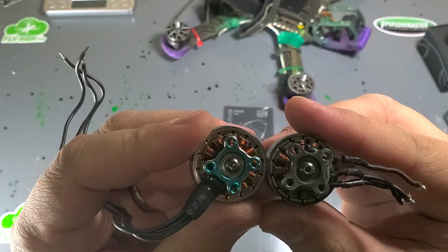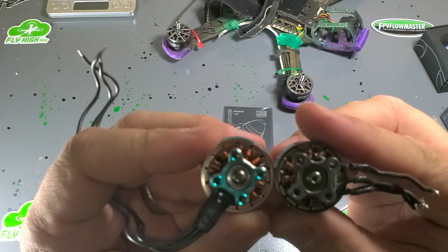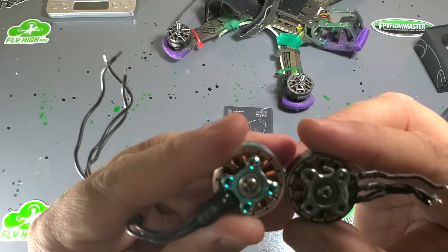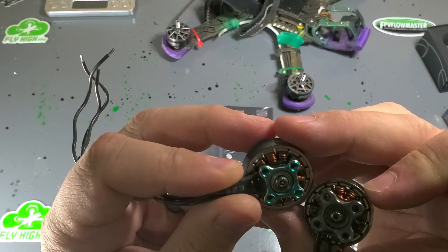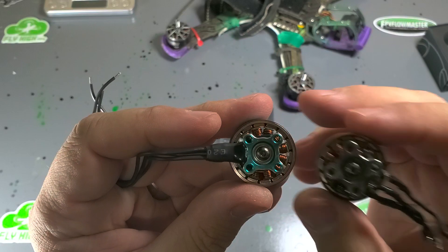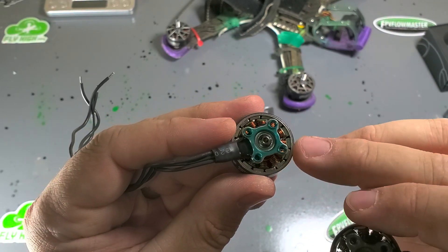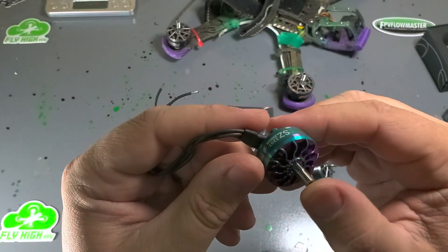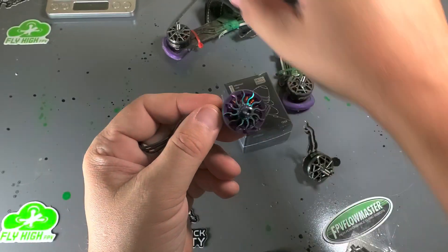You can see the magnets here — looks like they're both using curved magnets, but the T-motor magnets are quite a bit smaller; I'm assuming they're more dense. Air gap looks pretty tight. These do have a nice smooth feel, they're not very notchy. And you've got the typical steel ring underneath the bottom of the bell to help keep the magnets from falling out. All in all, it looks pretty decent — we're going to have to put it in the air and see.